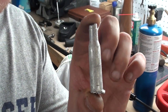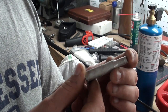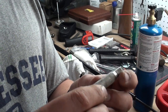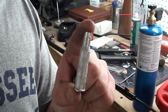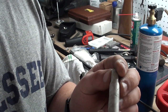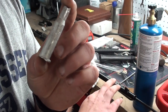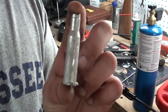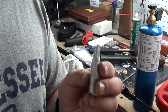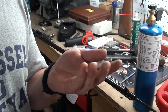We were able to get our chamber cast out of the rifle. This particular chamber cast — if you were taking dimension measurements to set up reloading dies and wanted to know the exact dimensions of your chamber — this particular cast wouldn't be good enough for that. But in terms of identifying what caliber this rifle is, I think we can all agree that it's a 7.62x54 rimmed. Of course going into this I knew that. This casting will be good enough to identify the caliber of the firearm. This can be melted down and reused again.